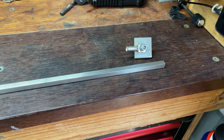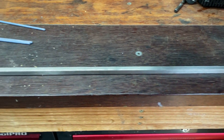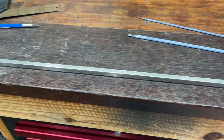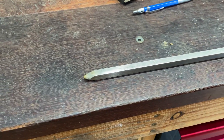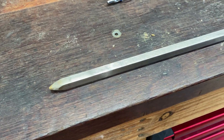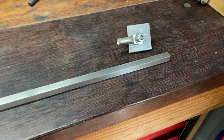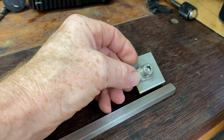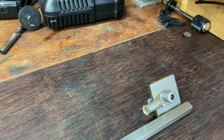I just returned from the steel supplier. I picked up the electrode for the surge protection equipment — a stainless steel solid rod. I'll sharpen a point on it. This will go 1300 millimetres into the ground, and on the end I'll be welding a tag on using some stainless steel welding electrodes.